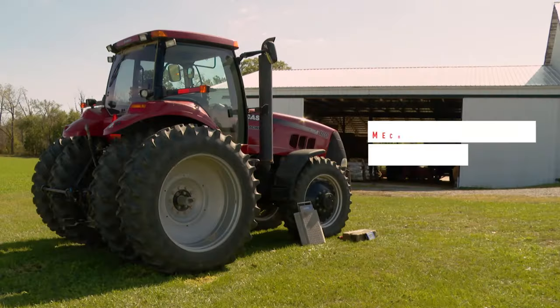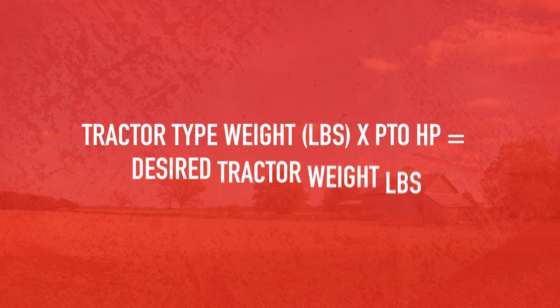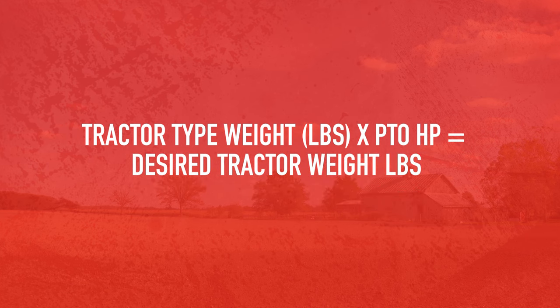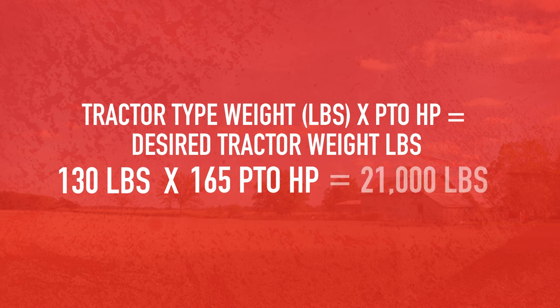The first step is to identify the horsepower and the type of tractor we're working with. Today we're working with a mechanical front wheel drive tractor that has 165 PTO horsepower. Once we know the power range, we can figure out the theoretical weight of that tractor. For a mechanical front wheel drive tractor, we want it to weigh 130 pounds per PTO horsepower. So with this example, we would take 165 times 130